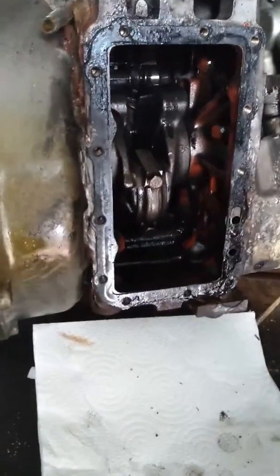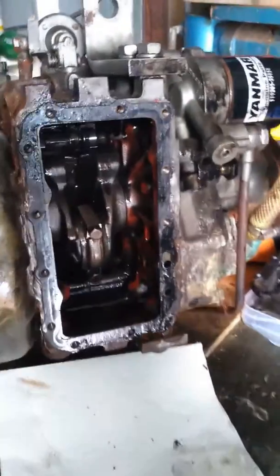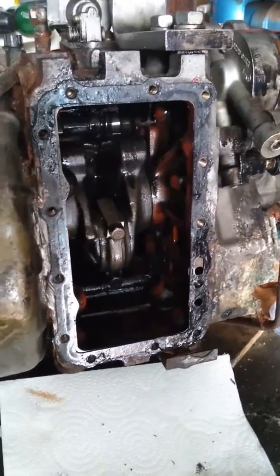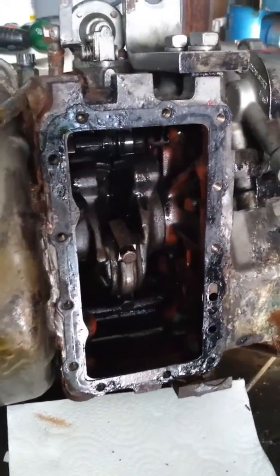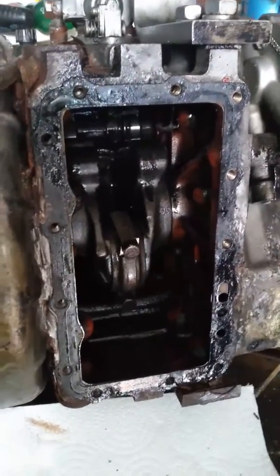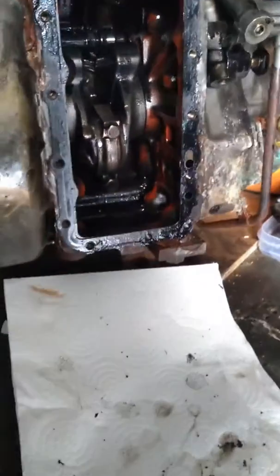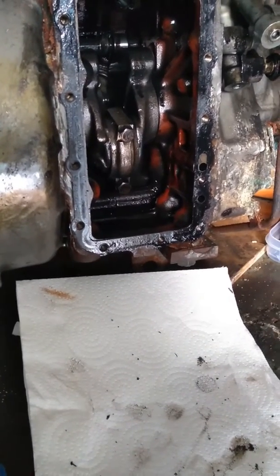We're finished with that now, so we're now going to take the bolts off of the big end, because we're hoping to be able to get the piston out and check the piston rings, but we're going to renew them anyway. We're hoping to be able to hone the barrel today, so two 12mm bolts, which Malcolm's already loosened off.